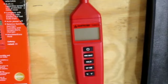This would be a good meter for calculating superheat, getting your temperature splits, and several other calculations. Since it measures humidity, you can also figure out your enthalpy and do capacity calculations. So there are several useful things you can do with it.